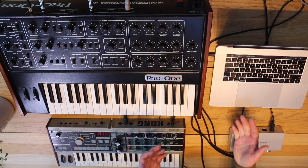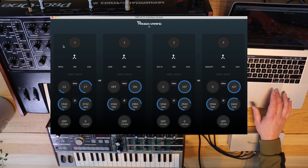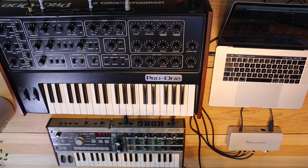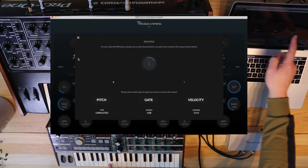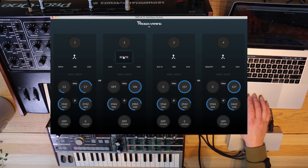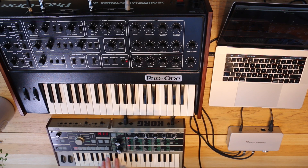It's really super simple to set this up. Here we've got the TA Programming app on the Mac, and you can see you've got four separate channels. I've got the MicroKorg direct five-pin MIDI into the TA Programming Converter. So if I route this — click on route — there we go, it's picked up a pitch, a gate, and a velocity. I'll say I want the pitch on channel one. Save that. On channel two we'll have the gate. Save. So now the MicroKorg is playing the Pro-One. Really simple.